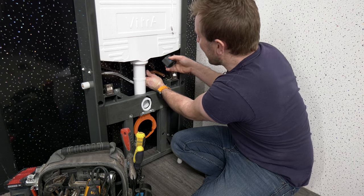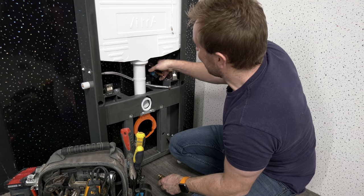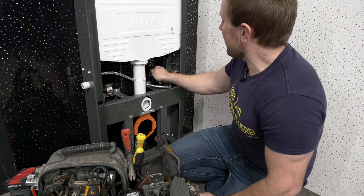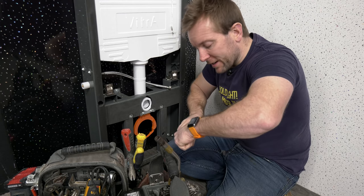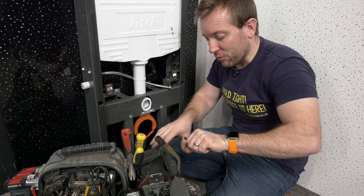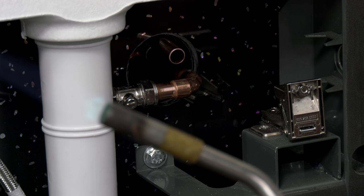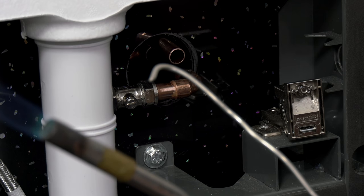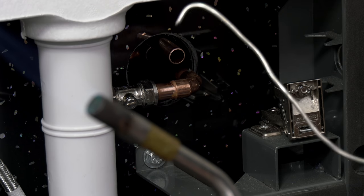Great pipework and serviceability — the two bits that every plumber should ever think about. Now, one thing I'd say when you're doing soldering: the cleaner the joint, the quicker you can get the heat away. It's obviously very important to get a nice clean joint — look how clean we've got to get that pipe. Real light flame, get your solder wound out ready, pop a little hook on there, and then attempt to touch each bit that you're about to solder so you know you can get to it.